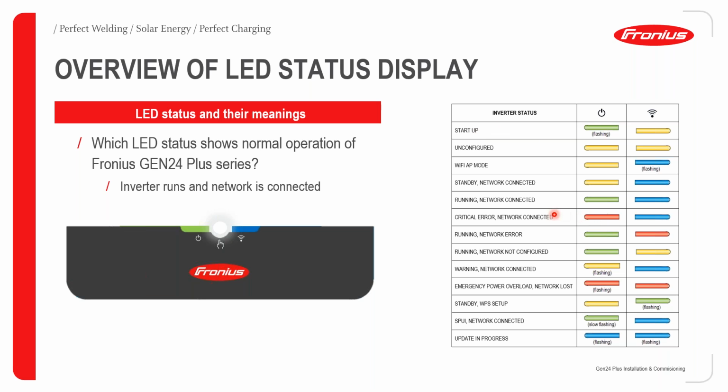However, if we look at this one over here, if our power LED is now red and our communication LED is now blue, this means we have a critical error, which could affect maybe the power board. However, we do know that the network is still connected, so the error is not with the network. If you look at the next scenario, the power is green, which means that the inverter is running fine, there are no issues. However, the communication is red, which now tells us that maybe the communication between the Gen24 and the local router is broken. Again, you can have a look at all these different LEDs and what they mean, and we will be sending this presentation out to you as well.